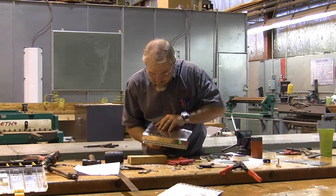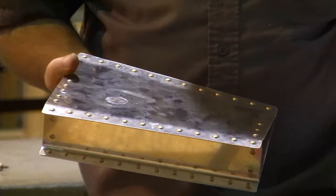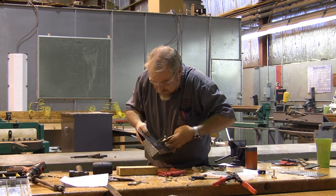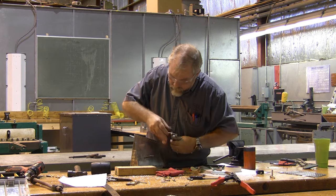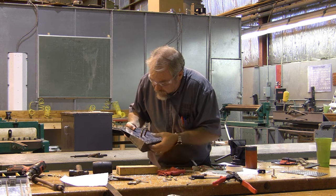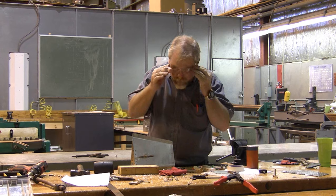I'm dimpled on the back of my doubler, but I don't have that same dimple set inside the holes here. Nor can I use my rivet squeezer on these holes. So I need another strategy to dimple those holes. Cleco 1. Two Clecos will probably be adequate for what we're getting ready to do. We'll Cleco it in place. And you can see our patch all in position here. And now what we need to do is dimple across here.